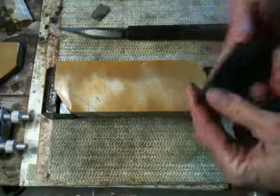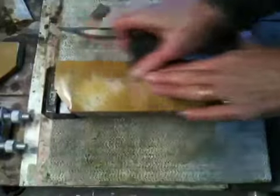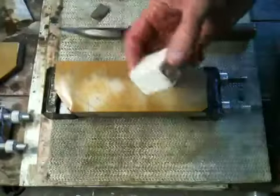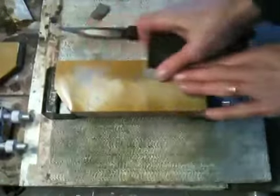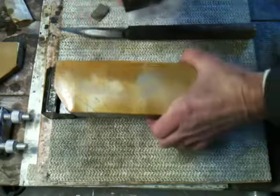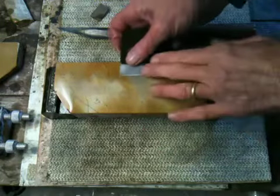So here again, this is the hard carbon steel, the ura side. There's quite a lot of suction going on, and therefore it's more polishing the blade than anything. Here's the Mikawa nagura. So we have a white slurry, and that adds a certain amount of relief from the suction, and therefore you're going to have a little bit more cutting action going on. You can see the slurry has turned gray. Not as fast cutting as with the diamond plate, but this is an option.